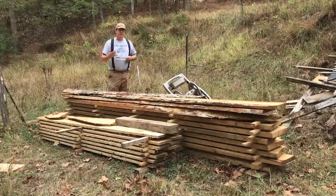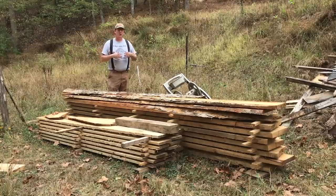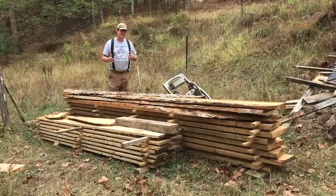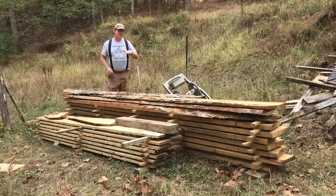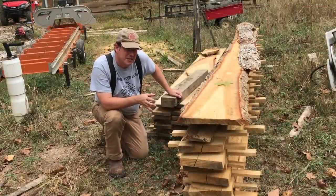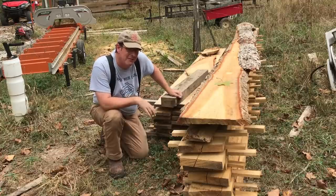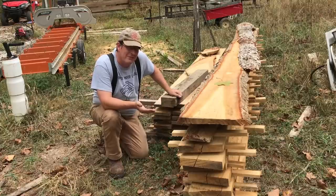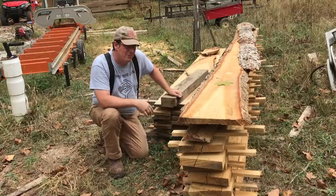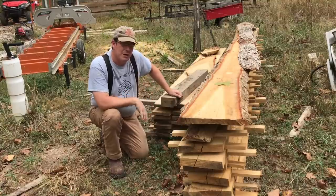Here at Red Tool House we don't have a kiln. If you go to a fancy woodworking store and buy white oak for a furniture project, you'd be buying kiln-dried wood — it's gone into a machine where heat and low humidity reduce the moisture, usually down to 10% or even as low as 5 or 6% depending on the project. In my experience here in West Virginia, boards left outside would never see less than 20% — our humidity is high enough all year that they just won't get much drier than that. Leaving them out longer, rot and carpenter ants become real problems.